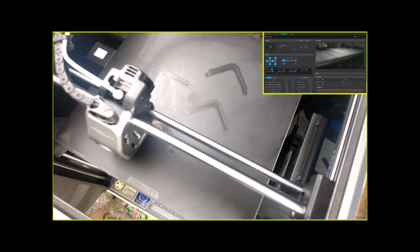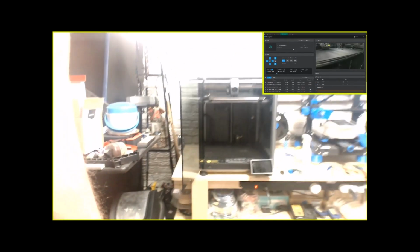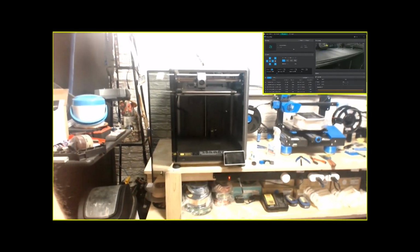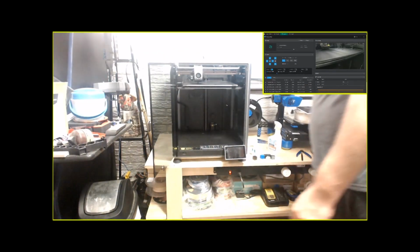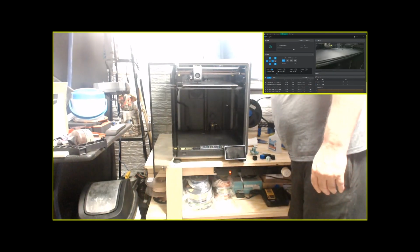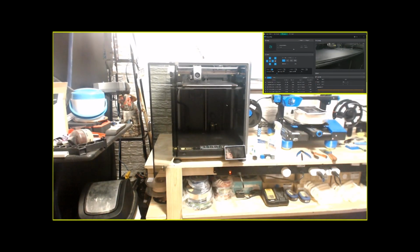Bird's eye view. And he's just winging. Okay, I did slow it down actually. This is only 250 max millimeters a second. On my Benchy and the cubes, it was 300 millimeters a second. So I slowed it down by 50. That's almost the speed I run my CR6s at. I run them at 60 to 70 depending on the part.